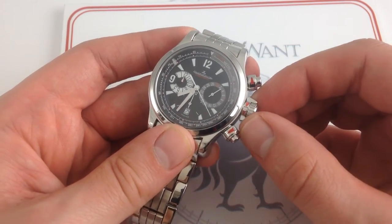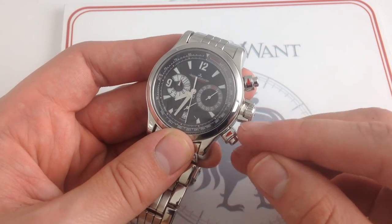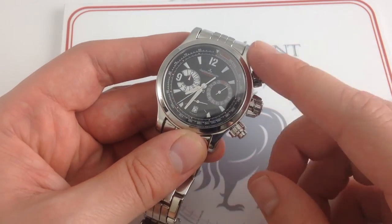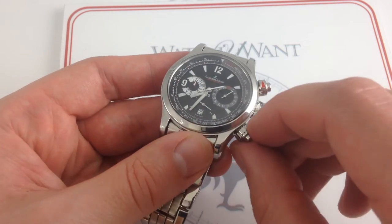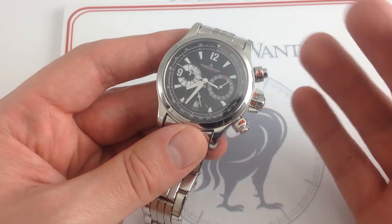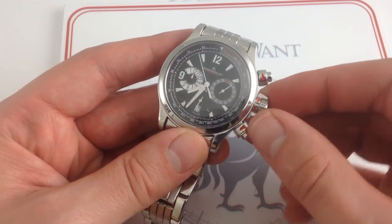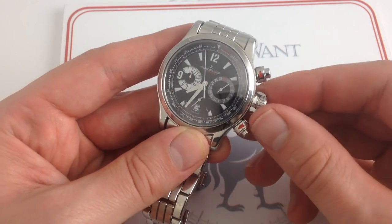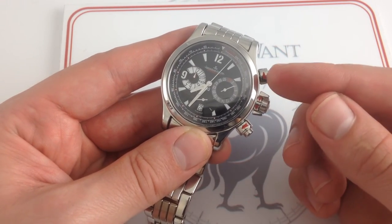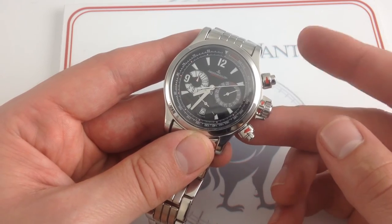It's not afraid to be its own thing and have a personality that's distinct from the pack, and that continues in the shape and function of the namesake of the watch — the compressor crowns themselves. You can see color-coded: red, you're not sealed, so you can use the functions but the watch isn't water-sealed. But a simple half turn — now white, you're tight. That's the genius of the compressor crowns. With a minimal turn, you can lock the watch, seal it for 100 meters, 330 feet, and then once again access its functions just like that. Now it's a fully enabled chronograph. I can wind, I can set, and I don't have to worry about wearing out the seals by threading the crowns in and out, because it's a toroidal system where the compressor simply compresses a donut-shaped seal rather than threading a threaded stem or a threaded fitting through the seal. So not just more convenient and easier to use when your hands are sweaty, wet, or gloved, but it also allows the watch to retain its watertight integrity longer between services.